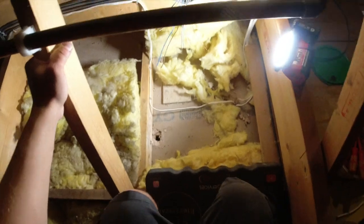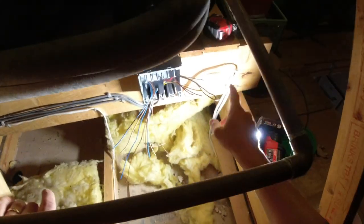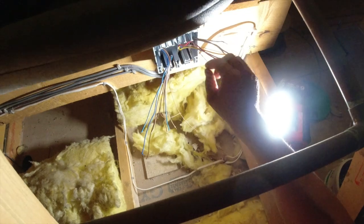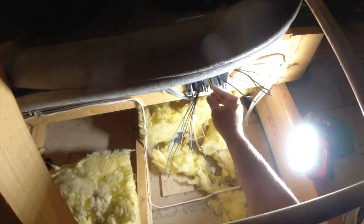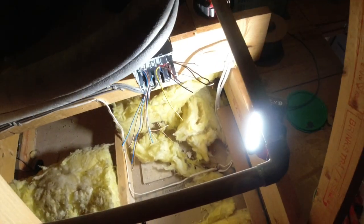Right, here we go. So, progress. Hopefully you can see what I'm looking at. We've got five cables, as I said. So one and two I've marked up here. One does the single light above the sink. Two does the three spotlights. It'll also be linked to the yellow here, which will do the fan. That'll bring the fan on with those three spots. We've wired the existing fan isolator cable round to the fan over there. We're yet to do that. We'll show you that. What I'm going to do now is probably just time-lapse this bit and just connect it up.